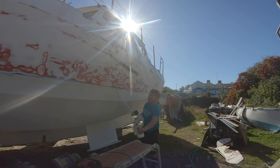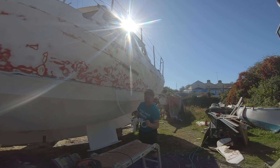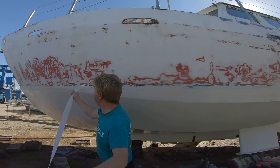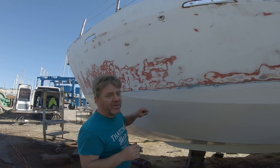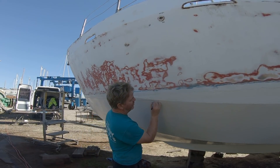I'm just taking off the top line of tape — the top line of tape was level with our waterline. We've got two widths of two-inch tape. This line I'm drawing now is along the bottom of the tape, and we know that when we come to put it back, it's two widths of tape up and it's the top of our original waterline.